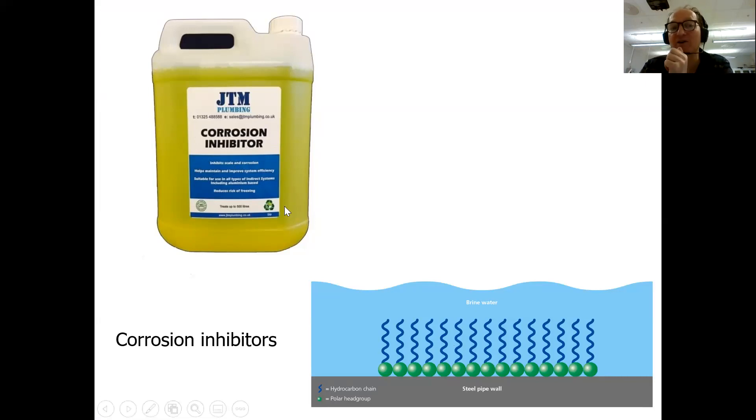The way it works is that the molecules in the liquid absorb onto the inside edge of the radiator, or pipe, and stick to the surface to slow down corrosion. These don't work for protecting the hull of a ship — you can't put a bottle of inhibitor in the ocean and expect it to do anything. You generally use them in a closed loop system or a tank, whether the liquid is water, salt solution, brine, or even acid.